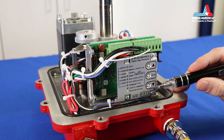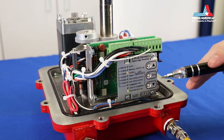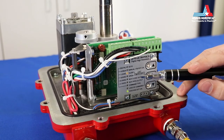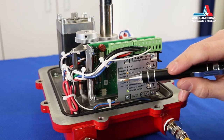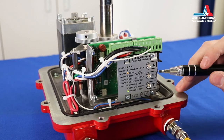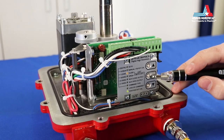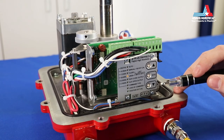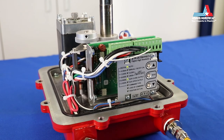The LED next to position L-CAL shall now be illuminated. If you do not have the optional transmitter module, you may skip this step. Otherwise, you will now set the output value in the closed position. You will need a meter between terminals 5 and 6 on the output module to read this. Use the arrow keys to change the value in the closed position. When you are satisfied, hit mode and set the value for the open position. When that is complete, hit mode again and return to the auto mode. When you are in the auto mode, your calibration is now complete.